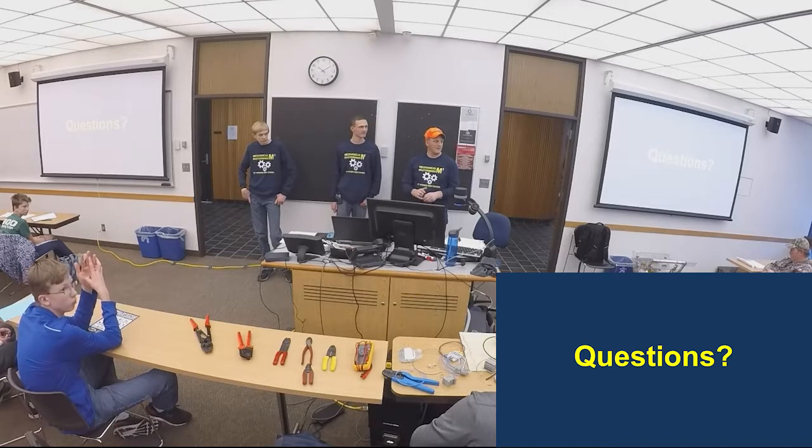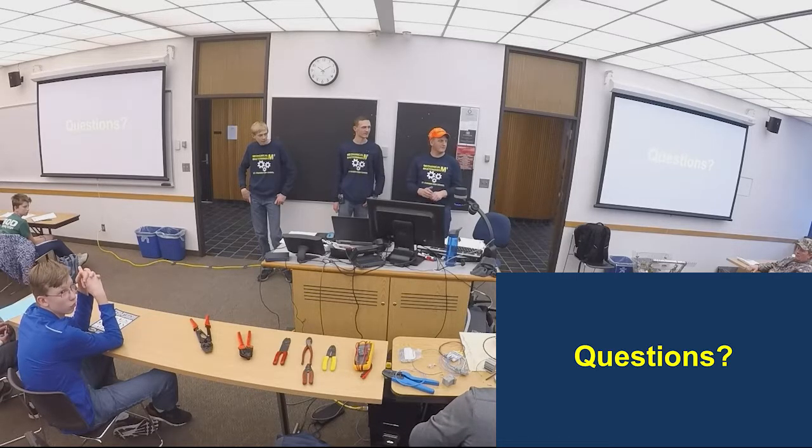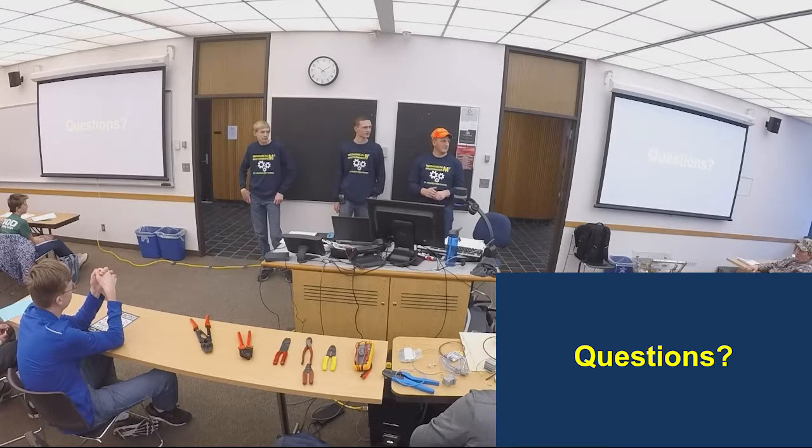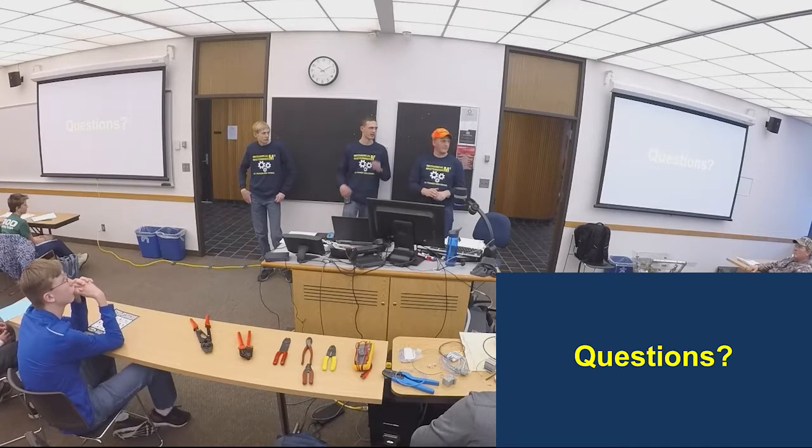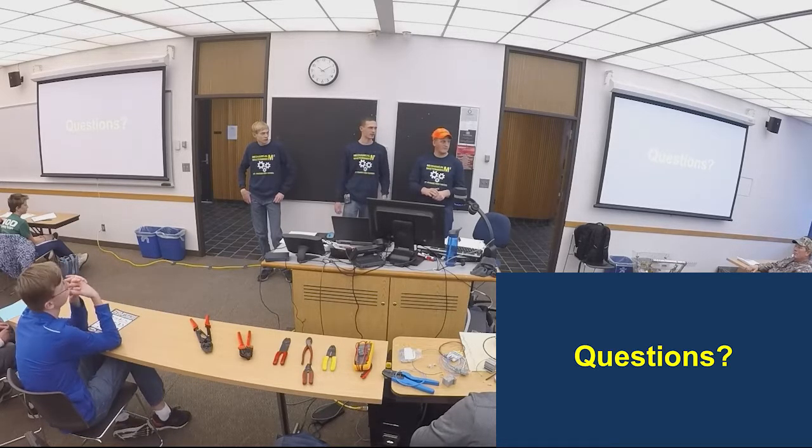I also want to ask a question, not to Todd, because I know Todd knows the answer. You mentioned the CAN bus on the PDP and the PCM. If we are using PWM motor controllers, do we have to use that CAN bus? Yeah, you'll have to use the CAN bus for your PCM. Your pneumatics control module requires CAN. But you're not going to link your PWM motor controllers in with that.